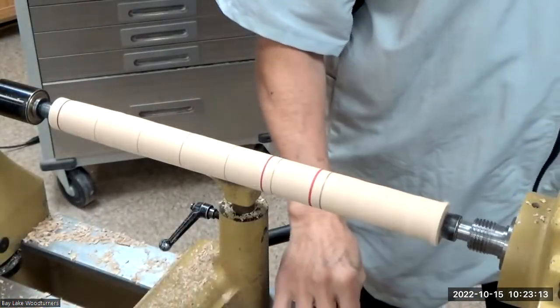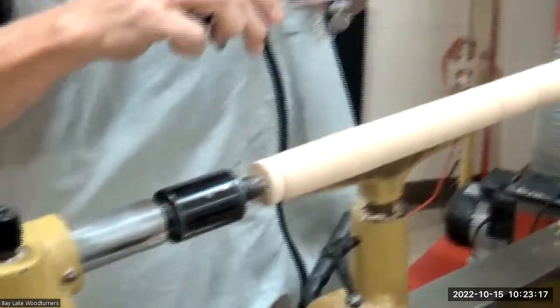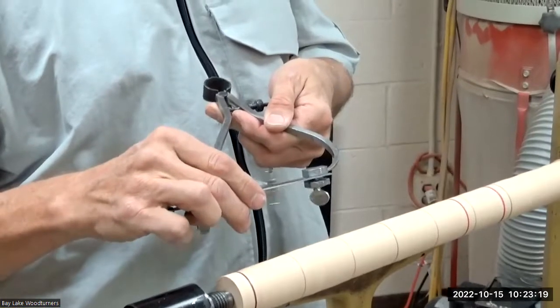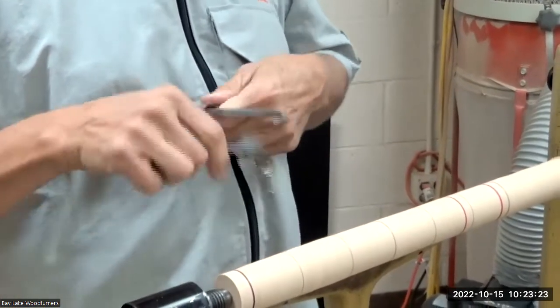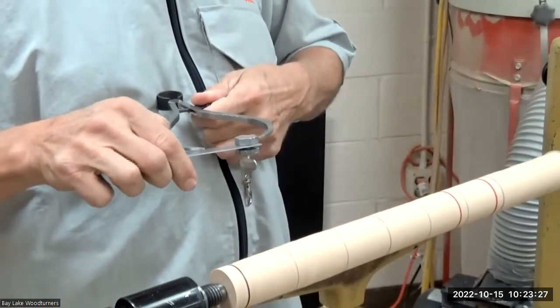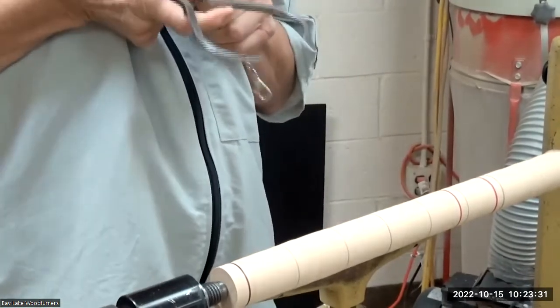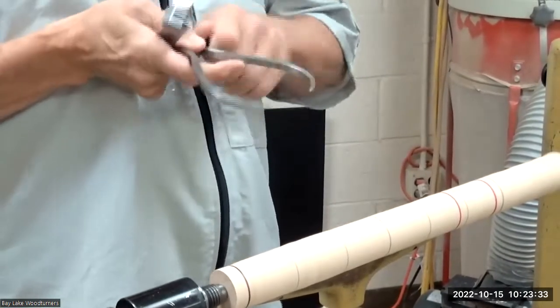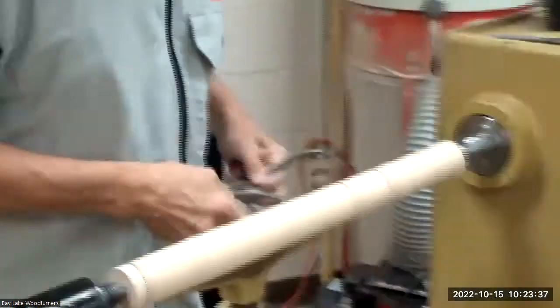The nice part is that I can rest one caliper jaw against that block really easy, and then as I'm adjusting my caliper, I can tell when I get the size that I want. I was always struggling trying to hold this on a ruler and then get the right size so that when I index my wood. So that worked out kind of good.